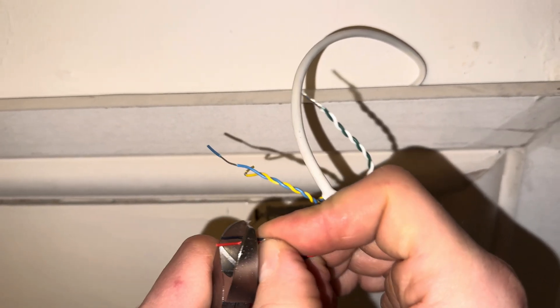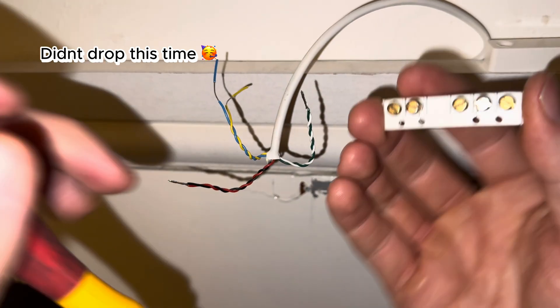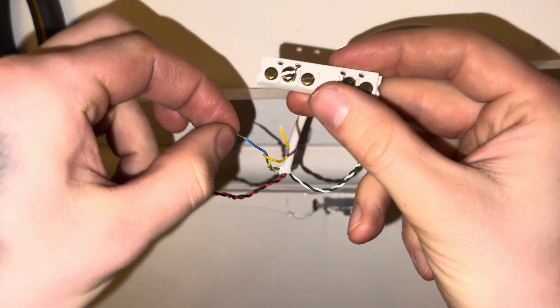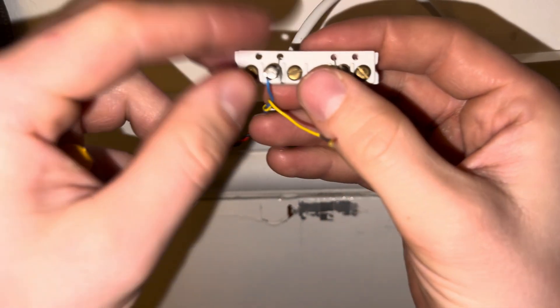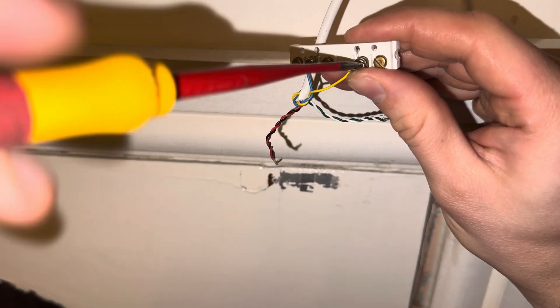Red and black, which is usually used for power, won't be used either, because on the vast majority of door contacts there is no AUX power. Here is the door contact — the terminals can pop out and there's a reed switch on the back. Unscrew the silver screws — not all the way, they have a washer underneath. Wrap the blue wire round and underneath the screw and washer. Handy tip: wrap the cable in a clockwise direction — it gets a better grab and stops it from coming out. Do the same with the yellow, wrap it clockwise, and tighten up.